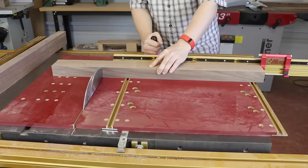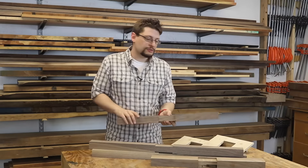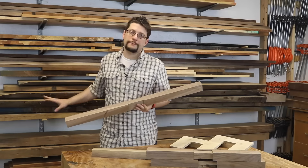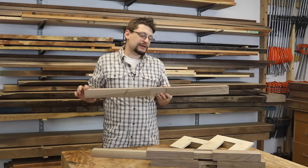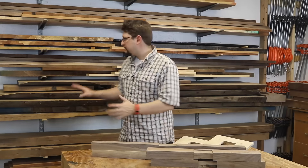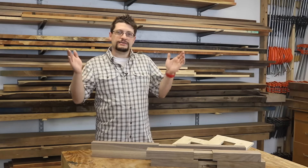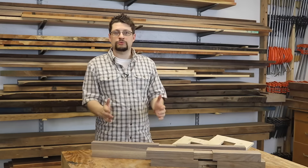Now let me talk about the lengths. The feet are 24 inches long — I know what that is. But what I don't know yet is what the trestle pieces need to be length-wise, because the boards for the table top are going to dictate that. So I made them extra long — sitting at 35 inches right now. I don't think the table top will be anywhere near 35; probably somewhere closer to 30 or 32. And these pieces end just before the edges of the table top anyway, so I've got some room to cut them down.